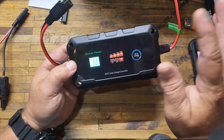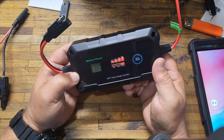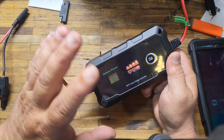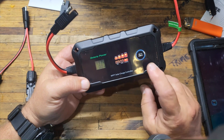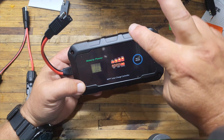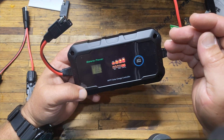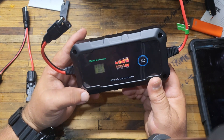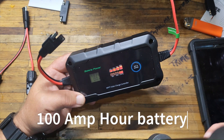Now I'm going to plug this into a 100-watt Harbor Freight solar panel because it has an SAE connection on it. This is a 20-amp controller, so it should be able to handle 300 to 400 watts of solar coming in. I also have larger 350-watt panels, and I've made an MC4 connection for those. When I did the math, this will absolutely handle up to 400 watts of incoming solar on a 12-volt system. If you switch to a 24-volt system it brings in more power and drops from around 16 amps down to 5 amps.